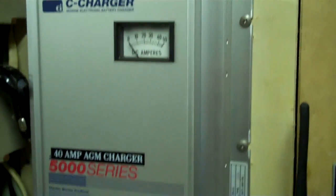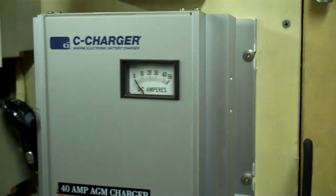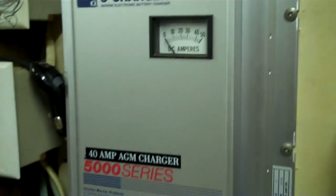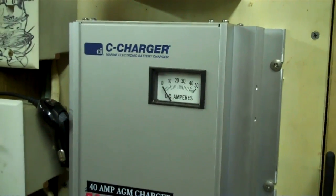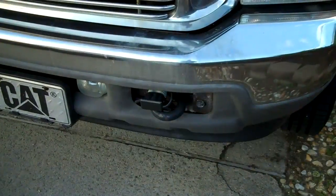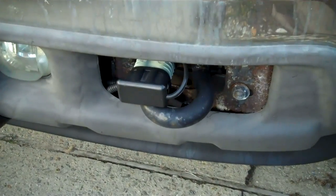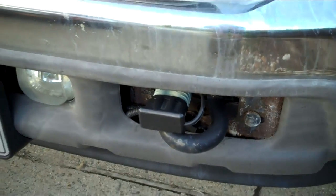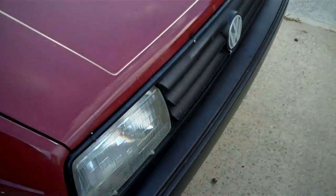You always need an alternative way to charge your batteries — usually that'd be a generator or things like that. This battery charger does know how to do it and it's specifically designed for an AGM battery bank. Your charge controllers know how to do it when they're programmed correctly. If your solar can't keep up, using your car — especially on a 12-volt system — is the best way to go, and diesel vehicles have huge alternators.